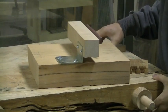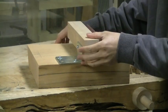There are a couple different approaches to cutting it. One is to cut the tails first, one is to cut the pins first. To me, it makes sense to cut the pins first. To cut the tail first, that's like driving your car backwards down the street. Nobody does that. I figured out a process which saves probably about 60% of the time cutting this joint, and I'll show you how I do this. To help improve accuracy in this efficient technique, I built a special jig here.